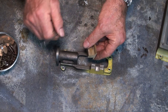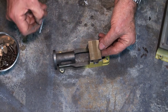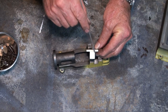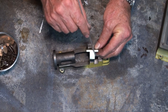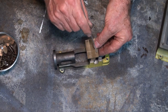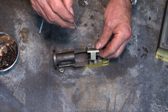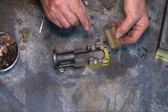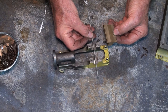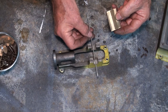So the next thing I need to do is to figure out how to make these bearings. They had to be drilled through on this end face here. A sort of a spigot or a lug has got to be formed on the outside of that, and of course it's got to be drilled through for the studs to hold the bearing in place. The most critical thing is that when it's assembled, the crankshaft can lie across that housing there, absolutely perpendicular to the axis of the engine, and also parallel to the base of the engine.